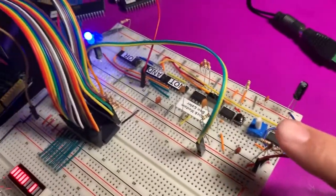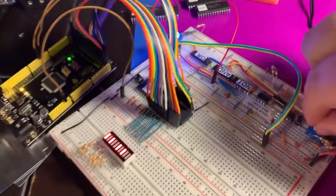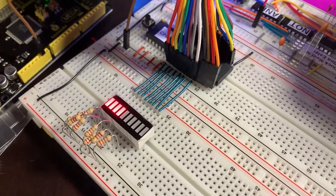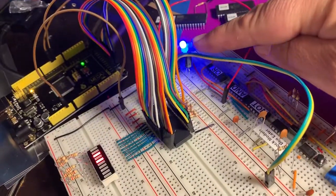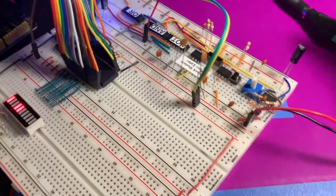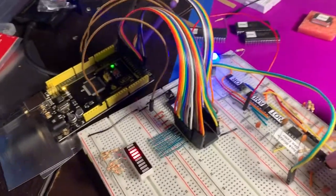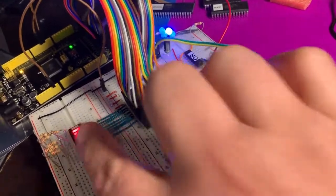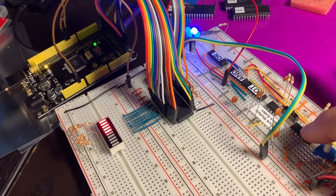This clock kit was a separate kit that I made the other night, mainly for debugging. I can speed things up — you can see down there it's going really fast — or I can slow it down. You can see the pulse, or what I call the heartbeat of the computer. Otherwise the computer's not going to do anything. I can also switch this over and give the CPU manually one cycle at a time, and I can watch that go up. It usually takes two cycles for the next digit to show up.